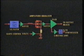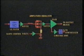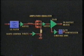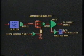After the gain control amplifier, the signal passes through the IF filter. This gives 60 dBs rejection to all except adjacent channel signals, and thus allows two-channel transpositions.